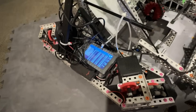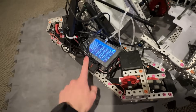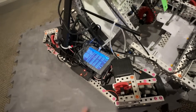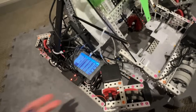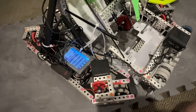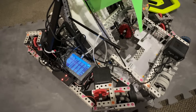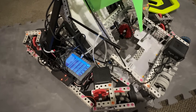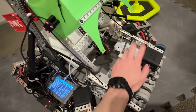We fried too many brain ports, and additionally we're having disconnect issues where the robot would just disconnect — it usually happened at least every other match. We tried everything: swapping out the radio, the battery cable, some of the motors. But by swapping from 12 motors to 8 motors, I completely solved the disconnect. Moral of the story: don't run that many motors at once. I talked to teams like Ghost and Pyro that have high motor drives and they said they had no issues, but I probably won't go up to 12 again. The 12-motor X-Drive was about 5% faster, and that's with current limiting so these motors don't actually lose any power.